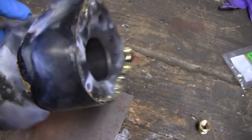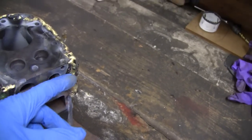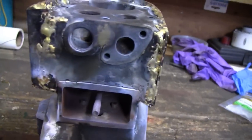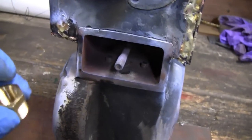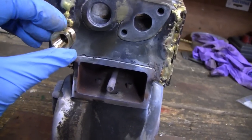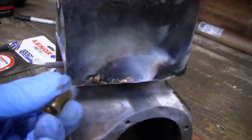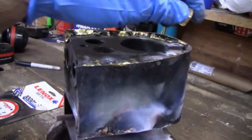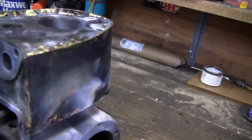Let me turn this upside down so I can cut in between these little grooves and shape the end. Right now it's completely sealed, so we need to make an inlet and an outlet for the water. I'll use a standard three-eighths to quarter-inch fitting, drill a hole, braze it in place for the inlet, and put one on the side for the outlet that goes to the head.